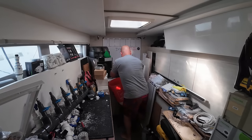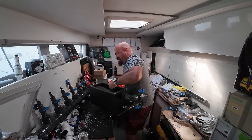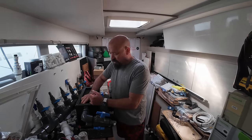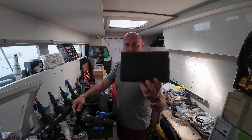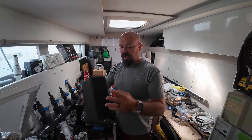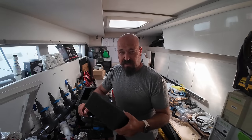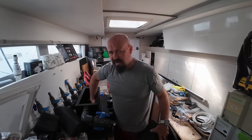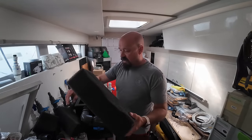It's a mess in here. Oh, this is heavy. Little tour around here — we've got a sea strainer coming that will filter out large debris. But in the meantime, they have given us this foam, which you think would restrict the flow of water but apparently does not. This is fuel cell foam, and it'll allow rapid transfer of water, but it will suck up all the little bits to keep them from getting sucked into the system. What I'm thinking is, after I get the new screen coming next week, I'll cut a small strip of this as a small filter that sits in front of that screen, and save the rest.